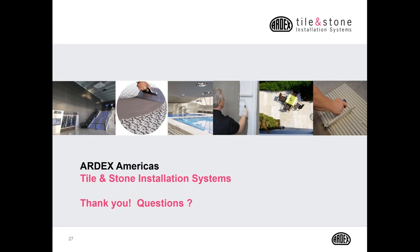Perfect. And the second part to Jeff's question, which I understand because he's in the Pacific Northwest where it rains frequently, can 8+9 be applied on a wet substrate? So, you know, again, back to that exterior facade, let's say that it's rained overnight and that facade may be damp. No, we want the surface to be dry to apply 8+9. So that's where proper tenting would probably come into play in that application? Correct.